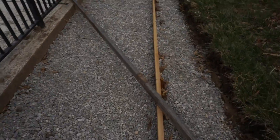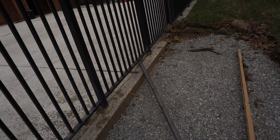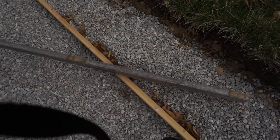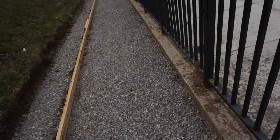Like right here — that's the angle, that's 60 degrees — so we want to wind up with that expansion joint right there where it comes in. I made a mark on it so we can cut it and put it in there and then we're good. You've got them on this side and all the way around because we're doing the whole deck.